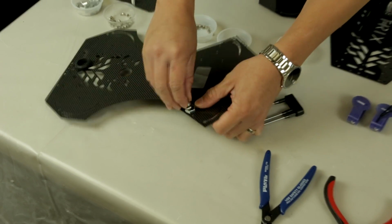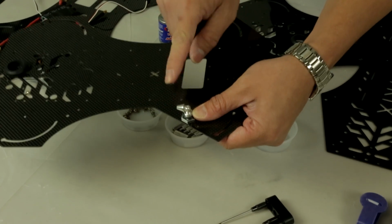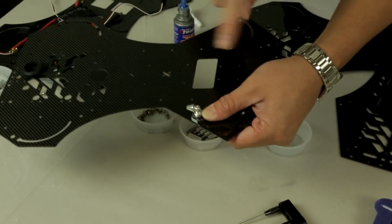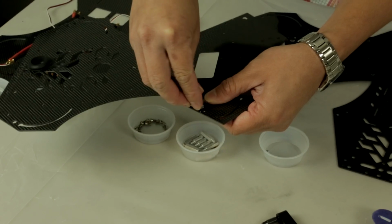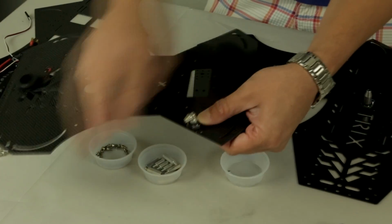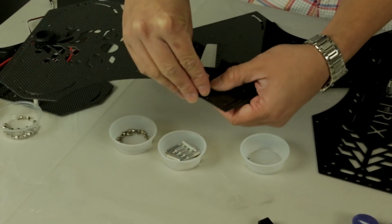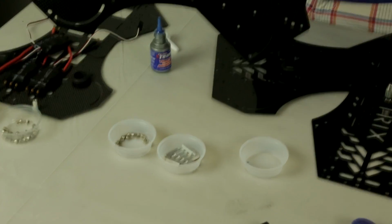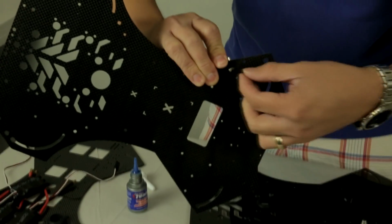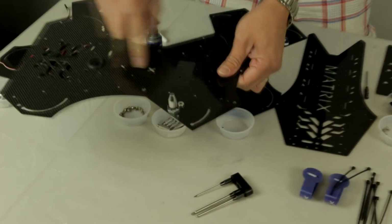Pick this up and you mount it in. Now, one thing you may want to pay attention to is which direction the GPS antenna folding mechanism folds to. We like ours to be folding a little bit outwards like so, so when you fold the GPS, it actually folds over the arm and not into any section, so you get a full complete 90-degree fold down. Once you have that done, you want to come over here, locate the screw, the washer, and the nut that comes with it, and just tighten down. And once you're finished, it will look very similar to what we have here. Rubber grommet, the foldable GPS mount, as you can see here.